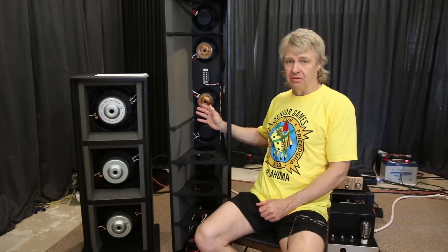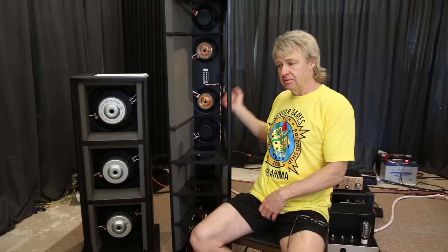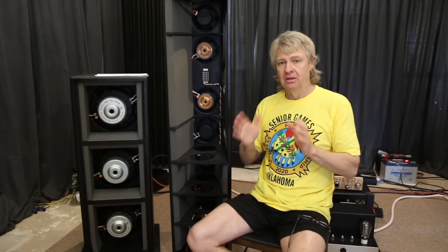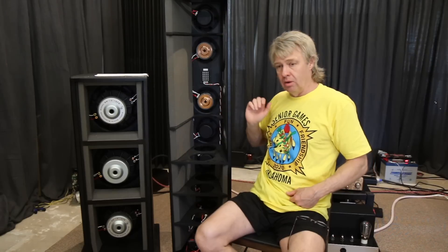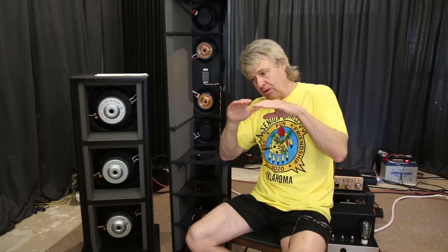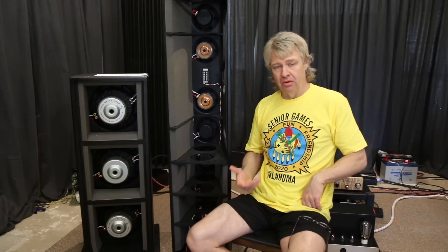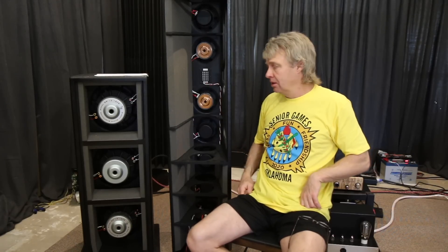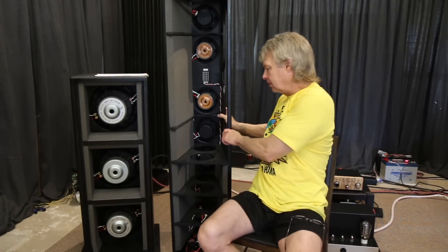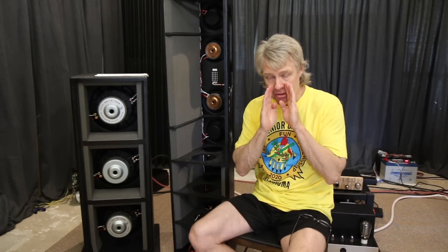When you get up into the higher frequency ranges, you have to take one side off. As you see here, it's more of an L-shape baffle as we get around the mid range drivers. That way you're not creating that megaphone effect and causing compression — it's still open. One wing can't cause that type of compression. The one wing does separate the front wave from the back wave, and the long wing with the little shorty is a way of tuning that roll off and extension at the very bottom of its range, keeping it flat. That means we use a minimal number of crossover parts to control it, because we're controlling the natural roll offs with the shape and size of the wings. Around the tweeter, we have a scalloped area that is cut away so that higher frequency range isn't cupped into a little area.